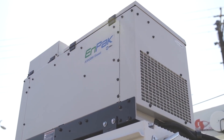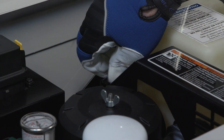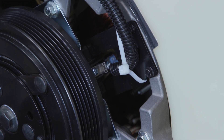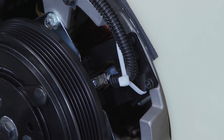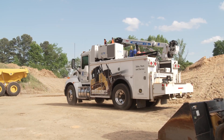Follow these steps to change the brush in your N-PAC A30 unit. Open the top cover on the unit. Remove the guard and belt to gain access to the generator brushes. Remove the screws that hold the brushes in place and put new brushes in. Be sure to reinstall everything correctly — the rib belt must be properly fitted in the grooves. Staying on top of routine maintenance helps optimize the life and performance of the N-PAC all-in-ones in your fleet.